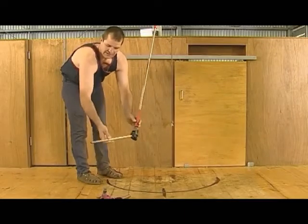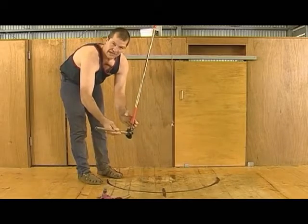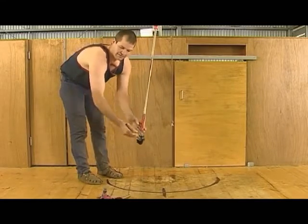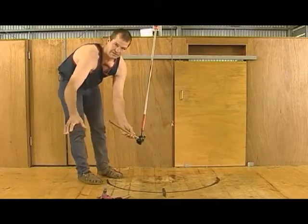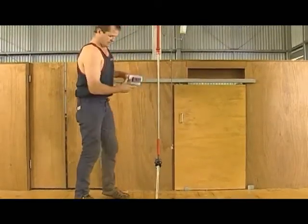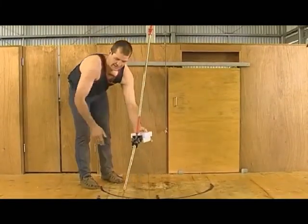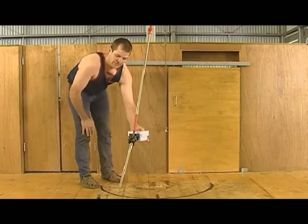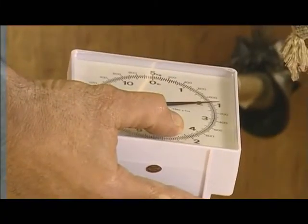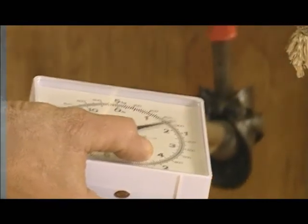If we're shearing out here, say if the sheep's over there, the amount of pressure that's on this down tube over there soon adds up, especially if you're shearing the whole sheep out of position. So I'll just grab the scales, and what we'll do, I'll push this out to the edge of that comfort zone, and you'll see that's up to over a kilo of pressure on the end of your hand, which is on the end of the handpiece.